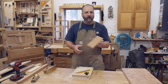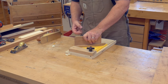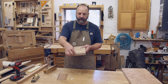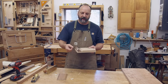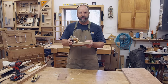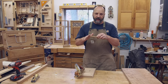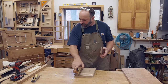The one thing this 45-degree stop doesn't handle is wider parts like box parts — my plane isn't that wide and it would be a precarious way to plane. So instead I have another shooting jig designed specifically for those types of miters. The top layer of the jig has an edge cut at 45 degrees, and there's a fence added — basically a strip of wood with a 45-degree angle ripped on one edge and glued down. This creates a V for my hand plane to sit in, which registers the plane at 45 degrees. I just throw the work piece flat on the jig and I can plane a really accurate angle while maintaining a square edge along its length.